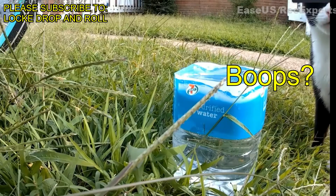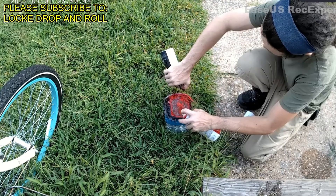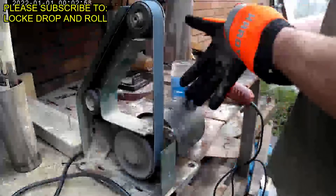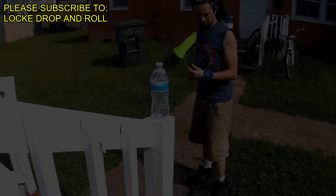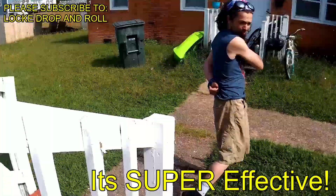When Truffle approves of your blade, you are ready to move on and it feels comfortable. Truffle is too interested in your hydro dip so you're going to have to get the cat away. Hydro dipping just involves taking some high-gloss spray paint — normally the good stuff — and spray painting the top of a reservoir of water, and you dip your handle right in. Generally it comes out with really cool designs. This one left a pretty sweet design and an awesome grip on the handle of the knife. We're going to go ahead and grind down our butt cap — I did this by tracing the bottom of the handle on a piece of brass and we're just going to grind until we meet the lines on the butt cap. This isn't forged in fire, so traditionally you peen your butt cap on, but I'm just going to be epoxying this one on. After that you can go ahead and bottle test — once again she passes through just nicely. Clean cut.